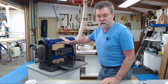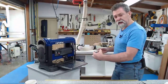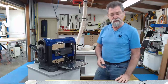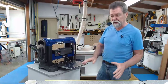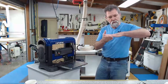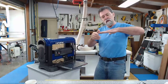This does 8 meters a minute. And it's got two power feeds, a power feed roller in front of the cutters and a power feed roller at the back to pull the timber through. Now, hence, this is where we get snipe. As you're pushing timber into a thickness, it doesn't matter whose brand it is, as you're pushing it in, the roller will grab a hold of the timber and might bump it down like that as it's getting a hold of it. And then you'll get...